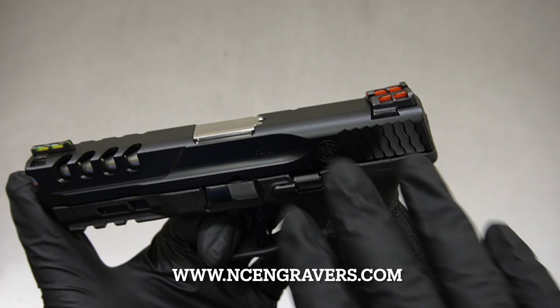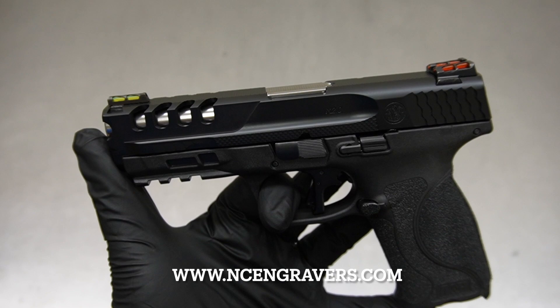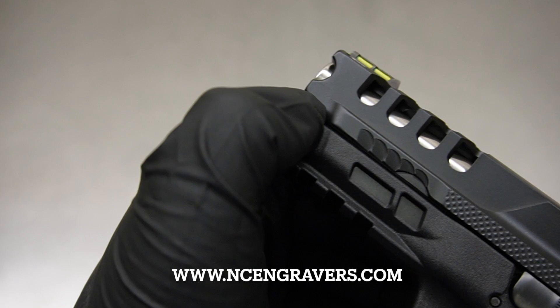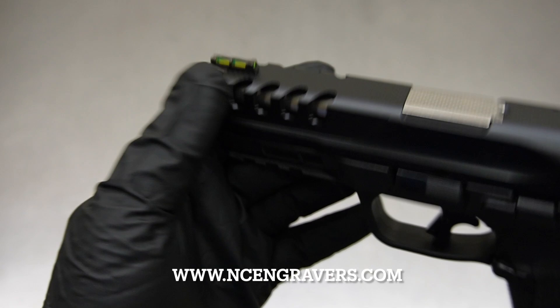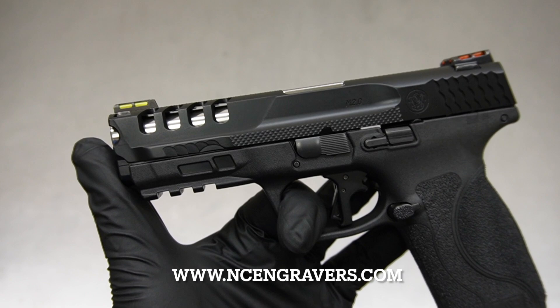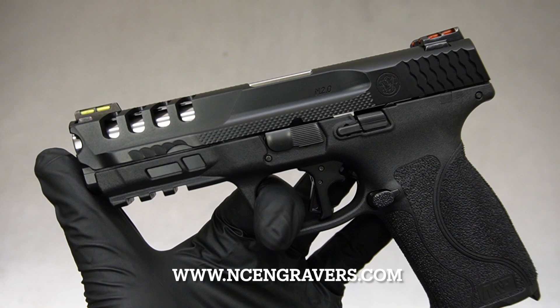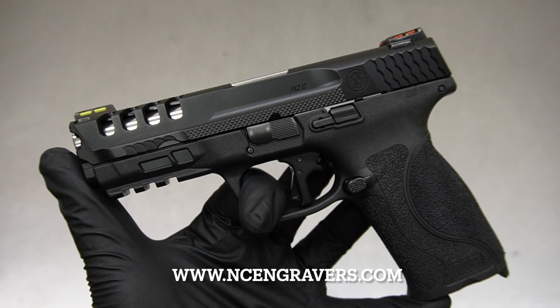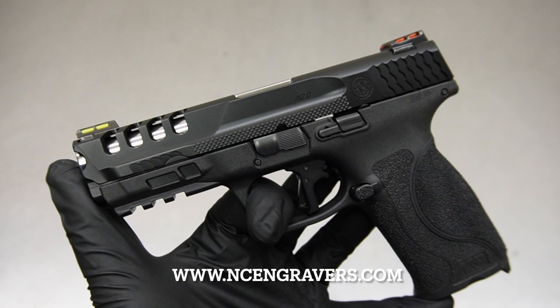One of the other things I want to talk about on this slide: we talked at the beginning about there being a wrinkle or roll right here. We did a side shave and a cobra nose, but that wrinkle was kind of down in this lower edge. We did our best to remove it — we couldn't cut it with a carbide cutter so we had to gently take it off with a high grit 240 Dremel wheel to basically skim it. You're cutting hardened steel and really just polishing it rather than cutting it off. Going with a lower-numbered sander would leave too many aggressive tool marks. We went ahead and did that to correct it without it being discussed with the customer.